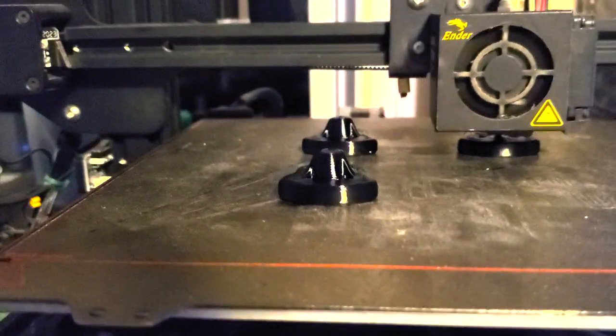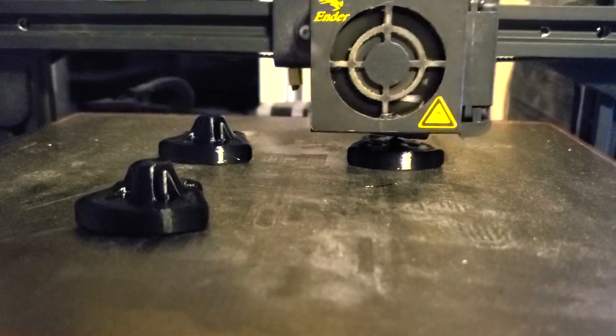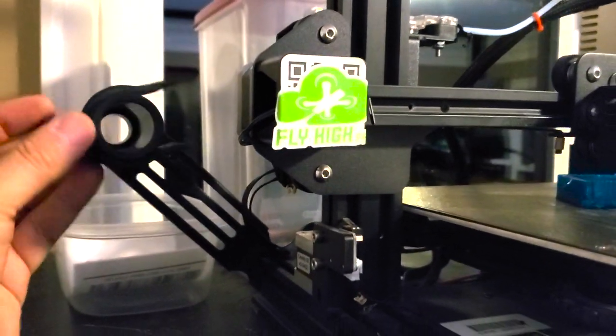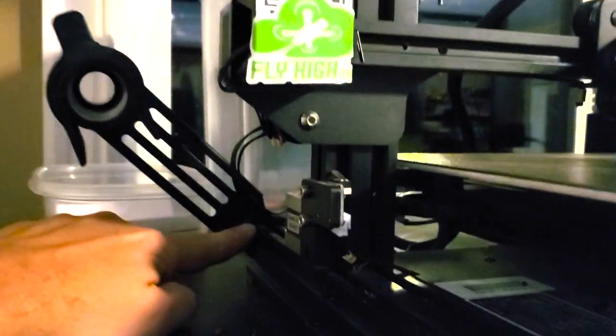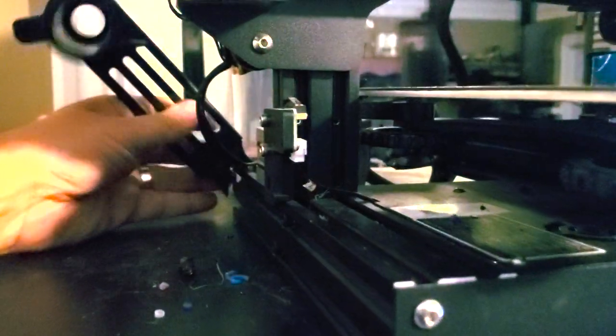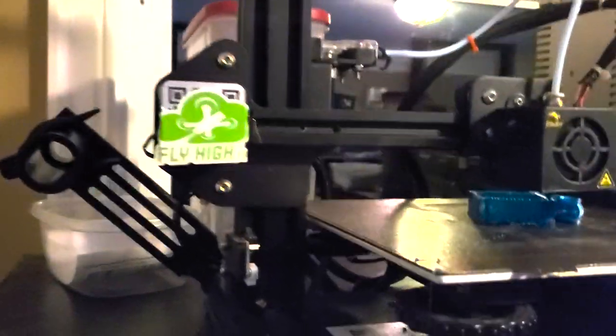It's easy. It prints easily. It's at lower temperatures. It's more forgiving. It's not so sensitive to water, so you don't need tubs and vacuum bags and all that stuff to print it correctly. You can just print it right out of your machine, and then get a roll or two of PLA and just start printing basic stuff. Print some stuff that you need for your printer, like one of these roll clamps and this little tiny bracket here that allows you to put your clamp right onto your extrusion rails, so that instead of having your roll up here and sticking up off the top and then having to come down at a weird angle to get into your extruder, you can just feed right directly off the top of the roll into the extruder.